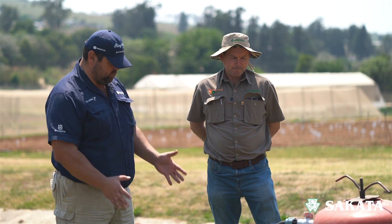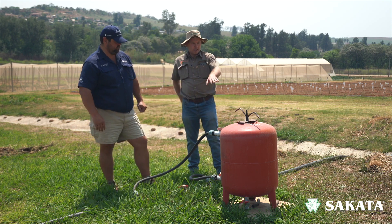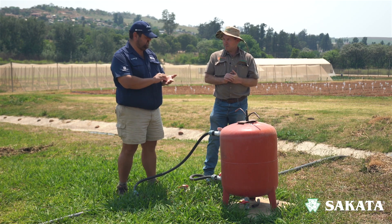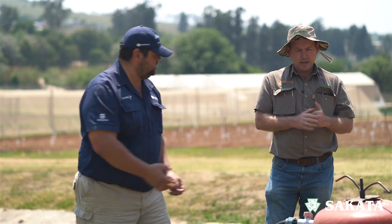So how does this thing work exactly? There are two taps and something that looks like ears at the top. Starting at the top: this is the lid — it's got a rubber seal inside. When we mix the fertilizer, we open this, put our fertilizer in, calculate the amount needed for the area and lines we want to cover — say 10 kilograms — then put everything in and tighten it up so it's properly sealed, otherwise it'll blow out at the top.